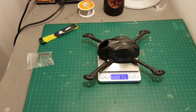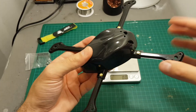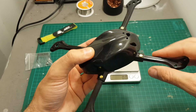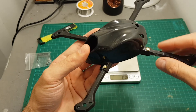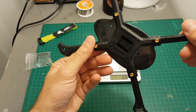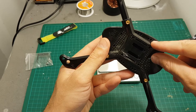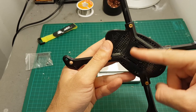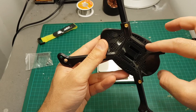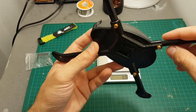The weight of the frame is 82.9 grams, so it's pretty light. To build it you will need to use a four-in-one ESC stack, because the arms are very narrow and it would be hard to mount individual ESCs on them — it would also damage the unique look. The motor wires should be inserted from the bottom; that's why there are three cutouts on each side, so you just wire from there and insert the motor wires into the holes.